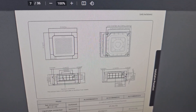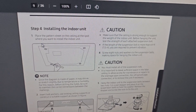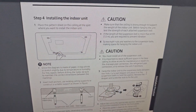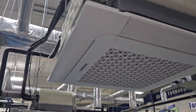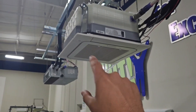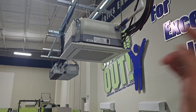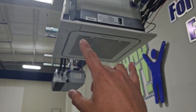The installation manual includes a pattern sheet you can use as a template. Here's a regular four-way cassette mini cassette, and here's a wind-free cassette — the difference being all of the micro holes. The mini cassettes are 24 by 24 inches; the larger regular cassettes are 33 by 33 inches. You can order the fascia panel in white or black, and it's square only. The 24 by 24 mini cassettes will sit in a drop ceiling.